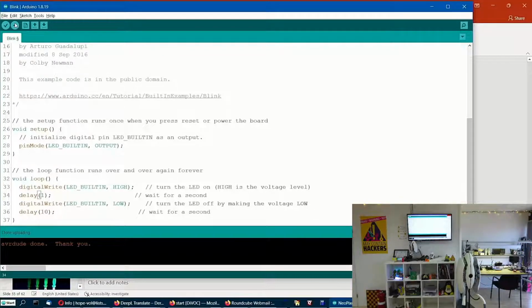And it's actually very similar to how I make arbitrary, cool, noisy, or beautiful waveforms to make music or noise with my music synthesizer. Except instead of the signal going into an LED, I feed the signal getting higher and lower at whatever rate I want to get pitches into an amplifier and a speaker. And depending on what note I press on a keyboard, it'll do that faster or slower. So that's how we do this, and that's called pulse width modulation.